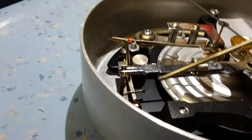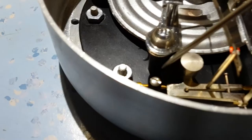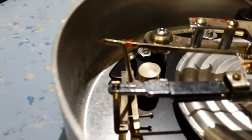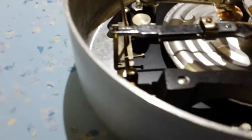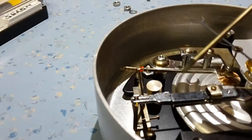That point there is then dropped down to this point here, which is on a pivot, and this pivot bar runs through to here. You can see these two screws here — they're pivot points. That point comes down to there and then it pivots onto there, so that's another form of amplification that will amplify the movement further. If you watch that screw head there and apply pressure, you can see the movement. That's amplified through all the levering effects, and the effects of levers increases the amplification.